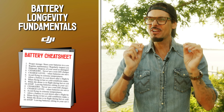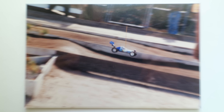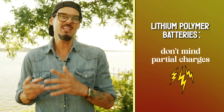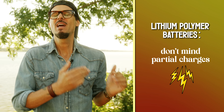I created a cheat sheet outlining all the important points — we'll go through that later in the episode. Here's something fundamental about lithium polymer batteries that I didn't know: they do not have the memory effect problem that old nickel batteries had in the 1980s and early '90s. I used to race off-road RC cars competitively — the batteries back then didn't like partial discharges before being recharged to full. But lithium polymer batteries don't have that issue. If you only do a short flight and use like 40 percent of the power, no problem — you can charge it right back to 100 percent and you're ready to fly again.